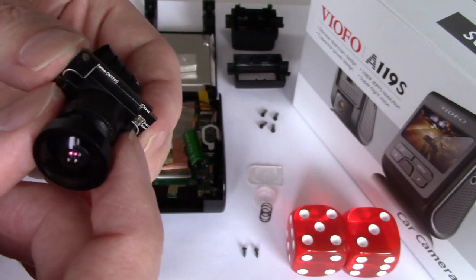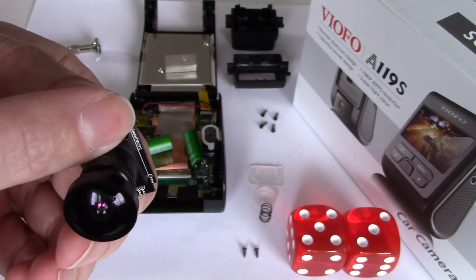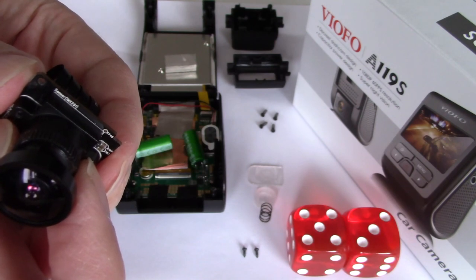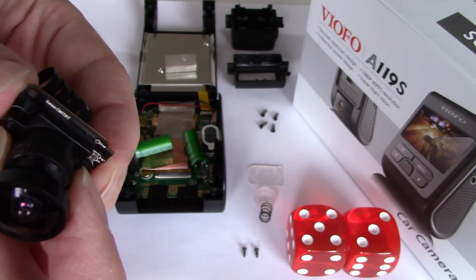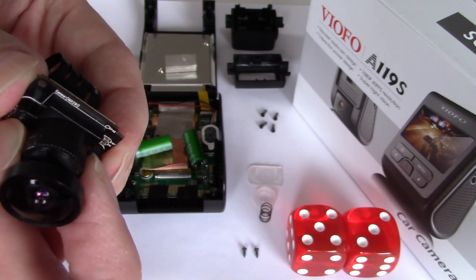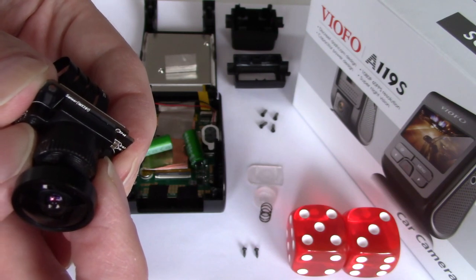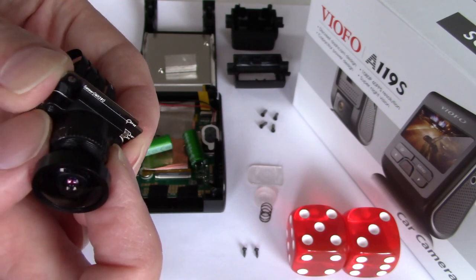Before you begin, note here at the top where the actual sensor name is — the word 'sensor' is silkscreened to the surface of the circuit board; that's the top of your image. Before you loosen the screw, note if you can see the line or if the line is fully visible. It doesn't mean too much other than if the bottom or top of your image is also blurry, this is how you would compensate. But what we want to do is maintain what it was previously. In my case I could not see the line, so when I shift to the right, I also don't want to see the line. If I suddenly see the line while shifting right, I've moved the mount too far.